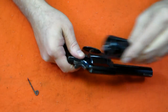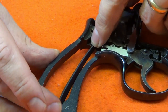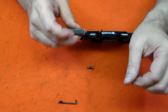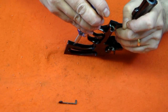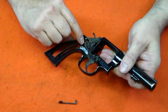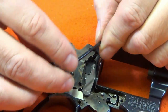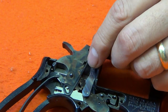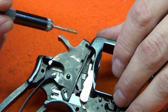We can remove the cylinder now. The main spring is installed by engaging the top hooks of the spring into the stirrup and the bottom of the spring into the slot in the frame. The spring is retained by the strain screw — fasten it snugly. Check that the bottom of the spring is centered on the frame and the top is properly engaged in the stirrup. Take this opportunity to lubricate the studs and the wear points.